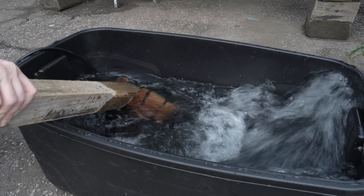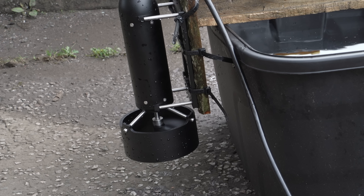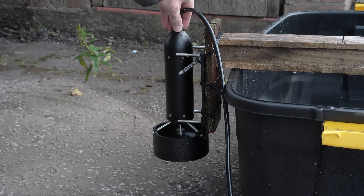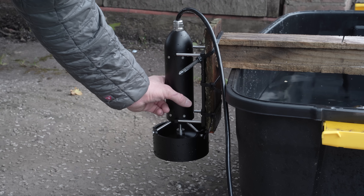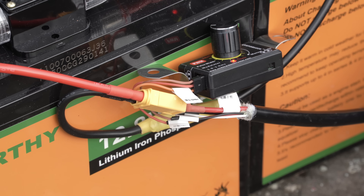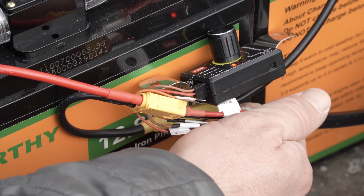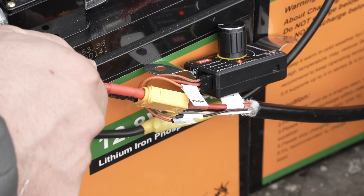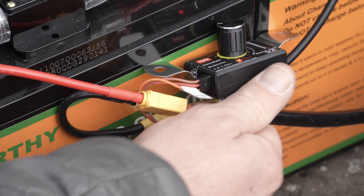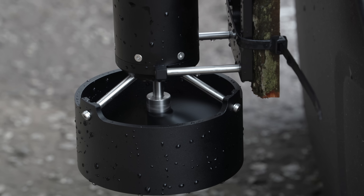I was determined to see if those wires got angry at high currents, so I thought — why not do a dry, or rather a damp test? I decided to spin up the motor outside of the cooling water and cautiously increase the speed whilst keeping an eye on the temperature of the pod's body. It didn't get anywhere approaching hot — I'd say warm to the touch even after a few minutes — so I took the power up to 100%. Then it was over to assess the all-important 16 gauge power wires. Unsurprisingly, with none of the length submerged, the wire became warm to the touch after about a minute or so. It didn't get hot, nor did it melt, blow or otherwise fail on this test, but I decided to stop after a couple of minutes.